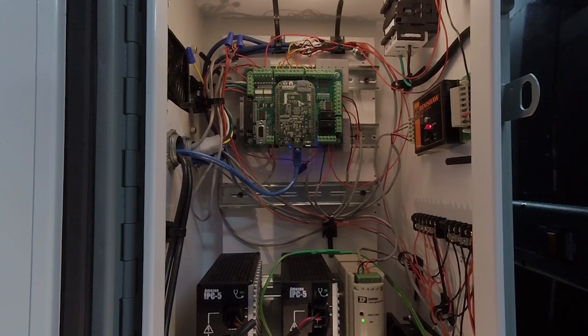On the bottom you have the 0-to-10 volt output for the VFD and power inputs. The right-hand side has the VFD common and reverse connections, plus relays for coolant flood, mist, and lubing system — all on that one compact board. A single RJ45 jack goes straight to the computer and you're off and running. It also has a spindle encoder port for rigid tapping, and an additional output port so you can hook it directly to a Gecko G540 driver if you're still running steppers.